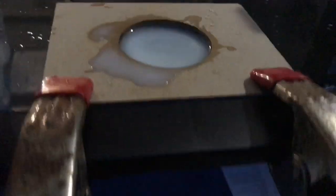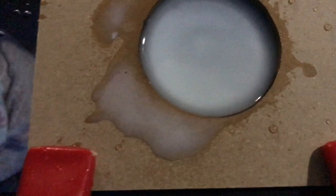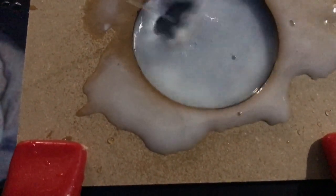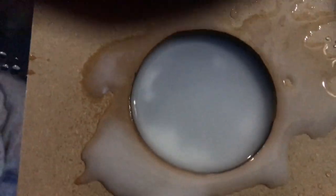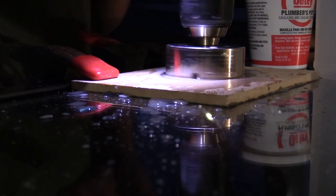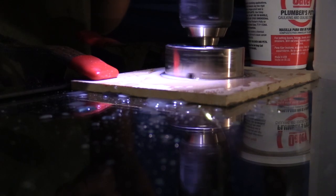After a while I started just spraying it with water and kept on drilling. I know it's kind of crazy that I'm not using a water hose — I just used a guide and a spray bottle. A couple of times I would stop, add some cool water, spray it, clean it out, and then continue drilling. I did end up using some of that putty once I made a little bit of a hole into the glass. I wasn't really pressing down on the glass at all — I let the drill do all the work.